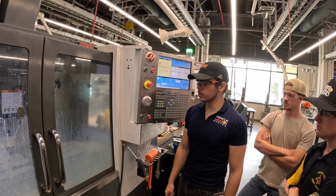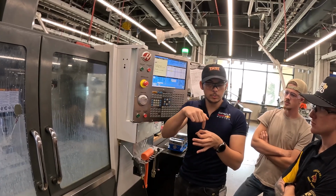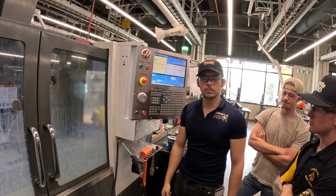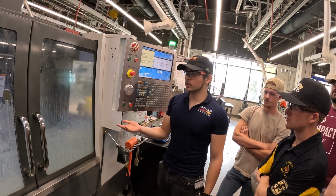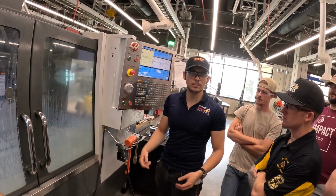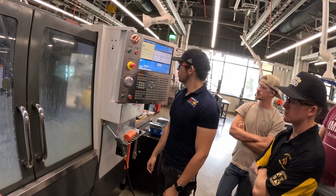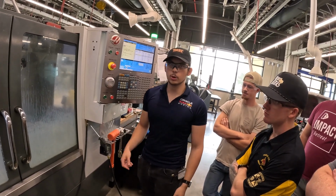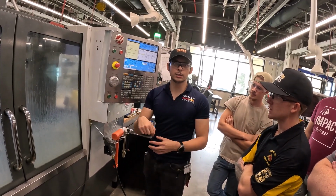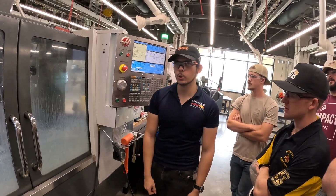Anytime I counterbore something, I drill it and then I take an end mill that's the same size or smaller and just circle mill. Almost always I don't have a counterbore, but I almost always have a small end mill that I can mill it with, and that's worked pretty well for me. If you're making 1,000 parts, a counterbore tool would be a lot better, because you can probably send that a lot faster than a small end mill. Especially on small drills like this. This is a bit of a tougher one.